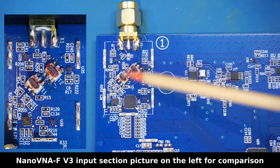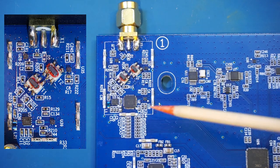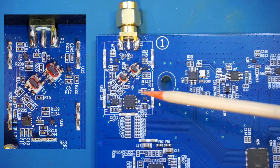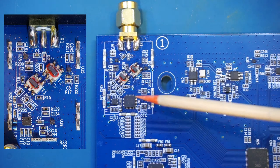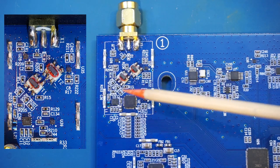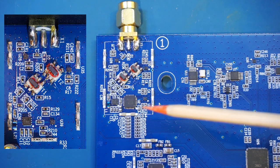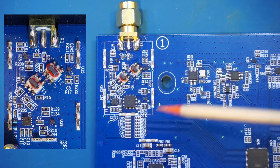We have the same RF transformers arrangements, but we do have an extra QFN chip. I don't recognize this QFN chip. Maybe someone more familiar with QFN markings can provide a comment below. But my thought is that this may be an attenuator chip. As you recall, we can change the signal output power from channel 1 on this VNA.